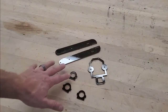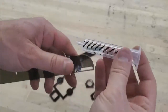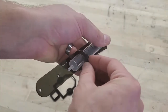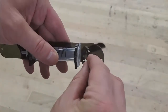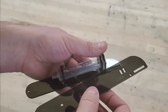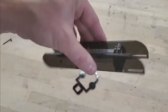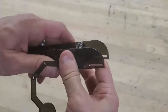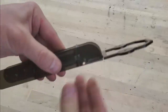To assemble the upper arm, obtain the required laser-cut pieces. Grab an arm piece and a syringe holder and push it into the second slot. Slide an empty syringe through — this can be tricky as you have to hold everything in place. Grab a second syringe holder and push it into the back slot. Grab the third syringe holder and place it into the front slot. Then carefully push the other arm piece into place so all slots line up. Finally, slide the claw mount into the grooves — the plastic will flex a bit, so wedge it into those two slots.